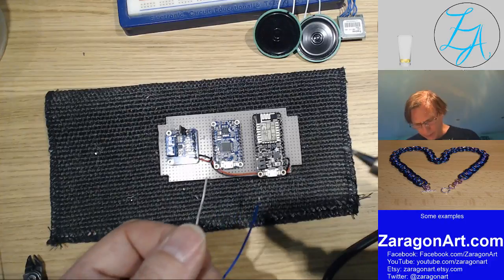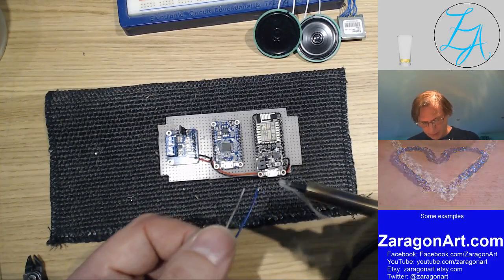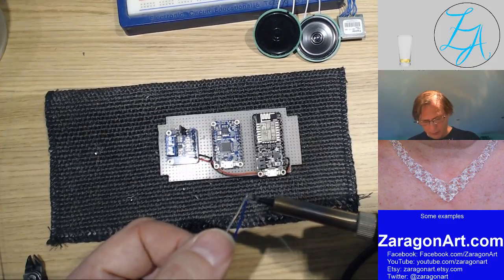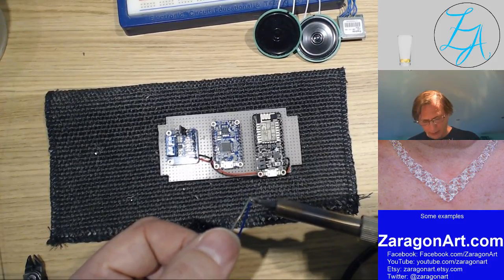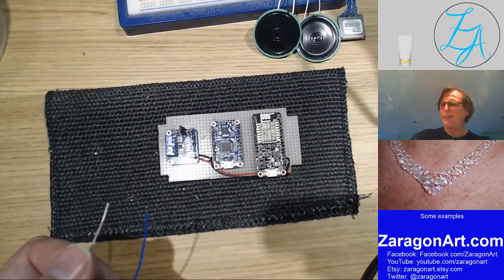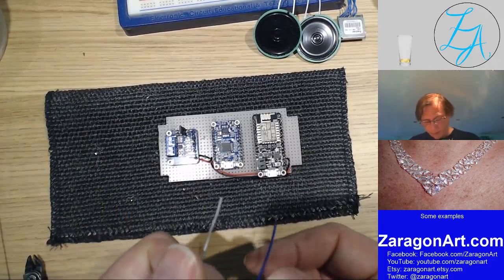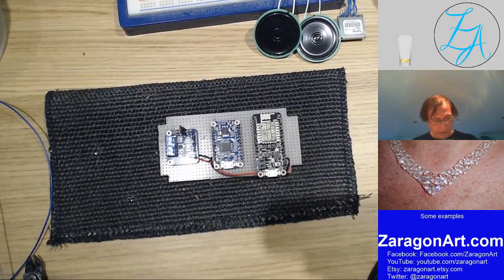I thought I had a sponge somewhere. Strictly speaking, if this was a commercial product, I would have to use non-lead based solder. It's not a commercial product, so I don't. That smoke is flux, because this is flux cored solder. It's not very good for you at all, but